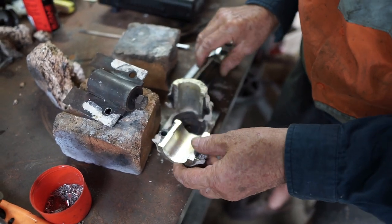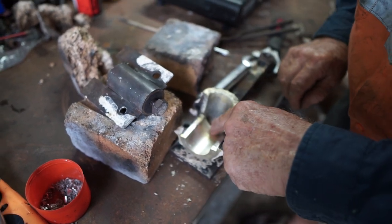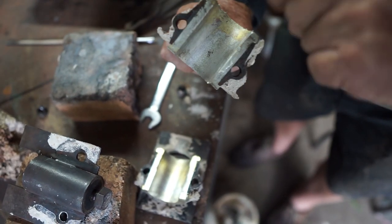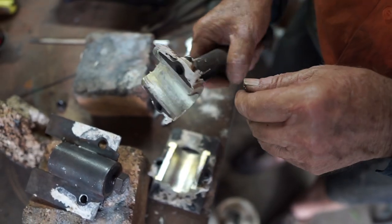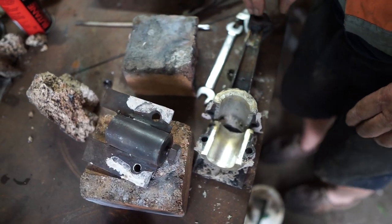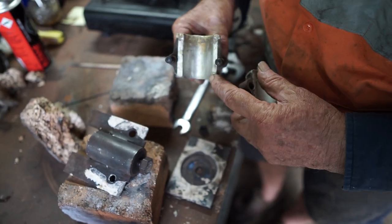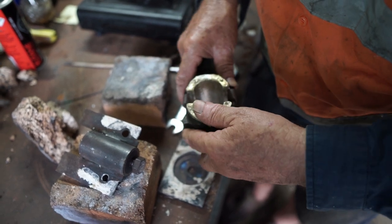And there it is, all apart, and you can see that it's still pretty warm there. We've got good metal through the main trunk of the bearing there, no holes, good bonding to the side, nice shape, and now we just take it over and put on the buff, clean it up, and there we have it, all buffed up. We now drill the holes out before we turn it up and just dress the top off. I'll show you how to do that when we do the turning.